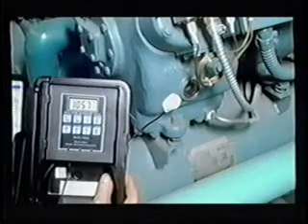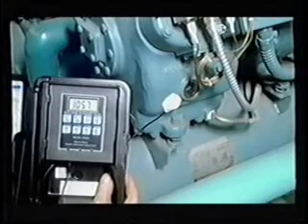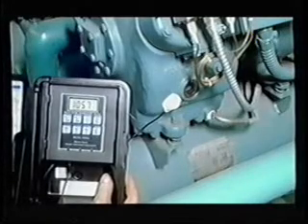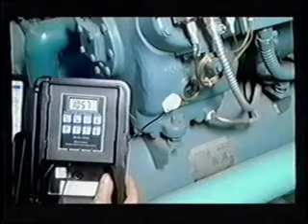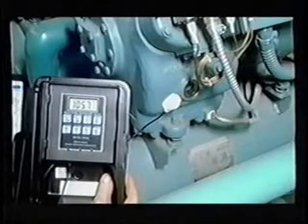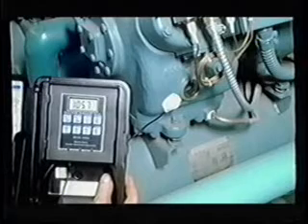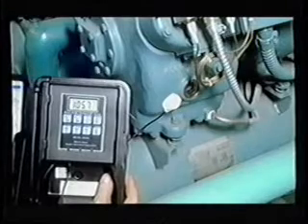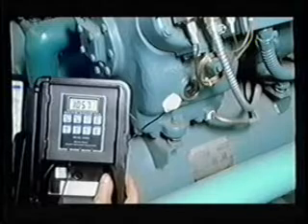The maximum crankcase temperature for 06D and 06E compressors should not exceed 165 degrees Fahrenheit. Temperature should be measured on the side of the compressor as shown. Fasten a thermocouple type thermometer below the oil level to achieve a proper reading. High crankcase temperatures could be caused by high compression ratios, high return gas temperature, blown gaskets or broken valves, and long periods of compressor operation in an unloaded condition. On 06Es, a leaking pressure relief valve can also be a cause.